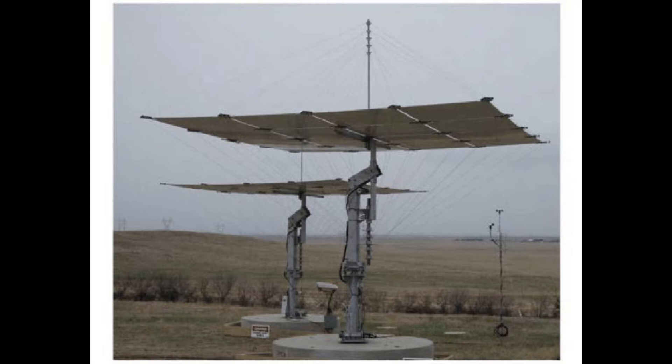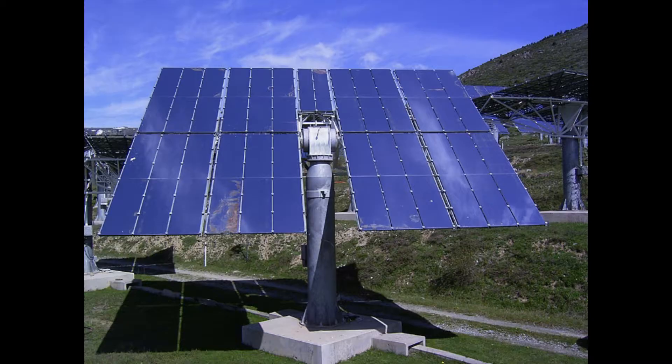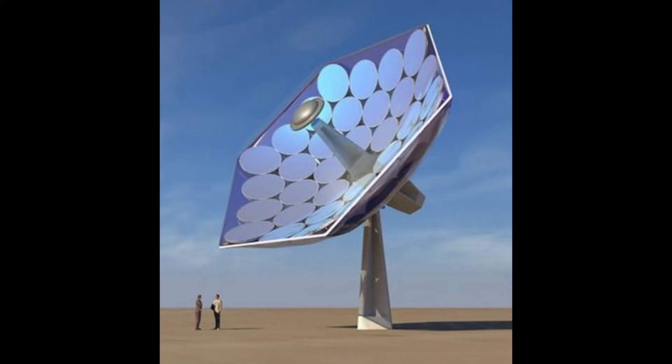but being a planar array, the target at the top of the tower must be at least as large as the reflected area. And the larger the tower, the more expensive the venture. One may think that each of the mirrors in a planar array can be individually focused onto the target, but that would make it a parabolic heliostat, which can only focus its reflection on an external target if the light source is stationary.